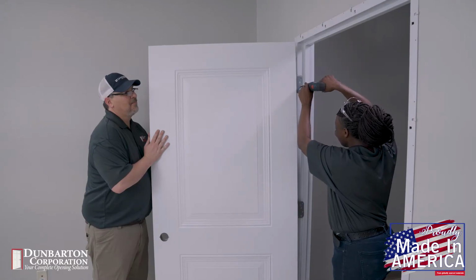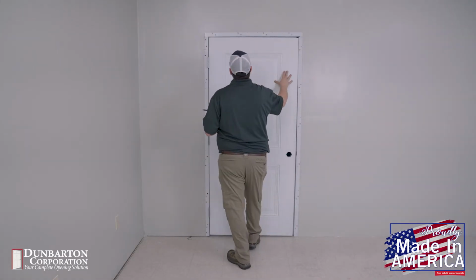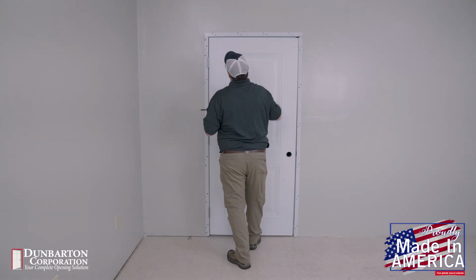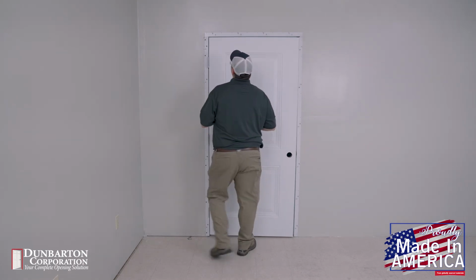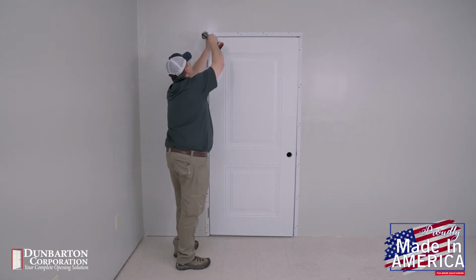Then screw the hinges to the frame. Once the door is installed, you can use it as a guide to square and gap the frame around it. Start by inserting a screw into the header on the door side. Make sure to pull the header down tight to the hinge jamb and that the end of the header aligns with the edge of the face on the hinge jamb.